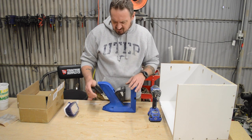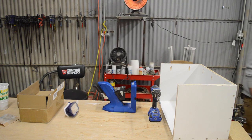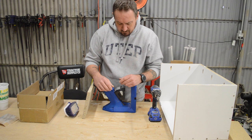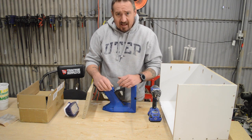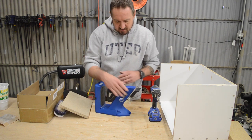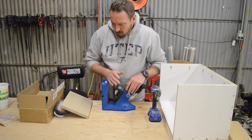The second thing on this jig that I'm not in love with is the clamping pressure. Let me get a piece of wood. On the K4, it had a lever-style horizontal clamp that you could thread in or thread out basically infinitely in terms of working with wood. This one has a little dial on this side that's used to increase or decrease the clamping pressure on your workpiece.